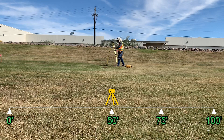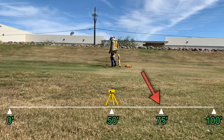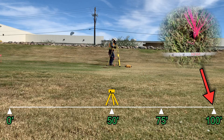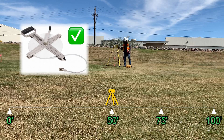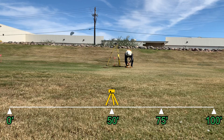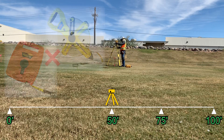To get started, we'll be setting up a 100-foot baseline, with points placed at the zero mark, one at 50 feet, 75 feet, and 100 feet. I find it easiest to use a 100-foot steel tape so that I can set each position accurately. I never use fiberglass or plastic tapes as they stretch and become inaccurate over time or in hot weather.